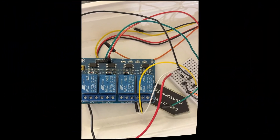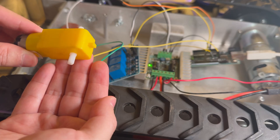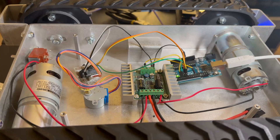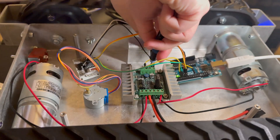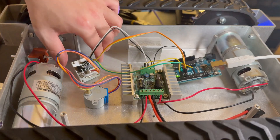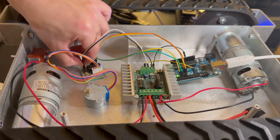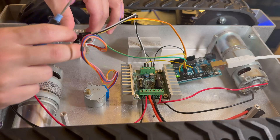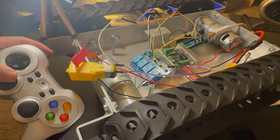Moving on to the relay — I have a four-channel relay and I'll be using two channels. One channel controls a servo motor acting as a tilting machine to break vegetation in fire line construction, and the other controls a motor pump to spray water on the fire. I was initially using a stepper motor with a stepper motor controller, but I quickly realized there were too many pins and I had to reserve them for the Boron. So I decided to use the relay to just control the servo motor on and off — I don't need speed control, I just want it to spin to break vegetation.